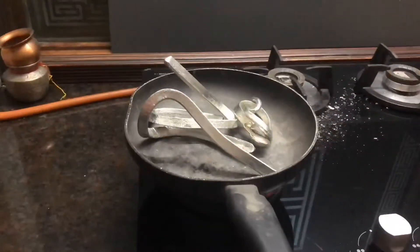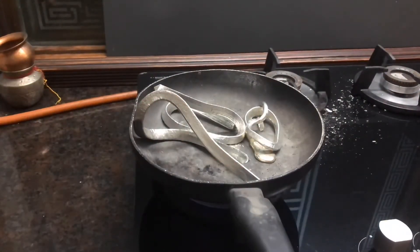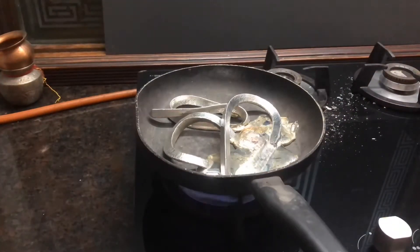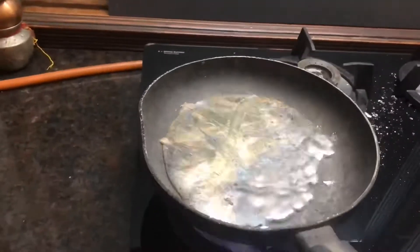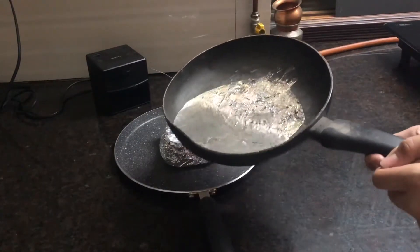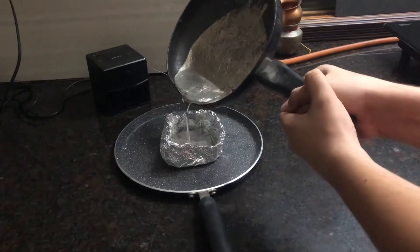Alright, moving on from that — let's melt the tin and put it in the mold. It is all melted and done, full-on liquid now. I'll just turn off the gas stove, get my camera set up, and let's put it inside our mold and see how this does. It's quite heavy — this is about a kilogram and a half of tin in like 100 milliliters. And it's dropped in, filling the mold — hopefully there are no leaks.